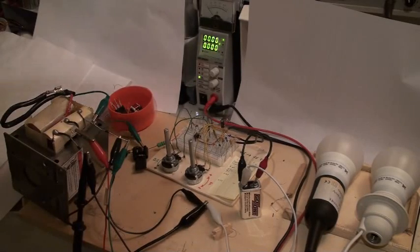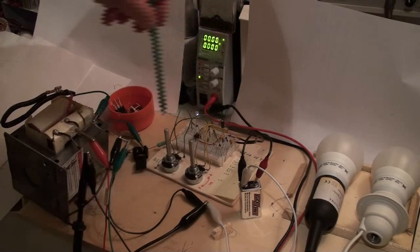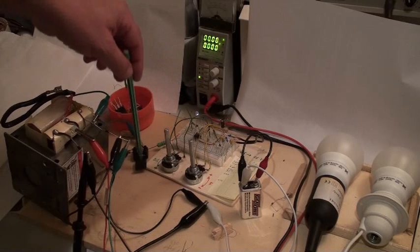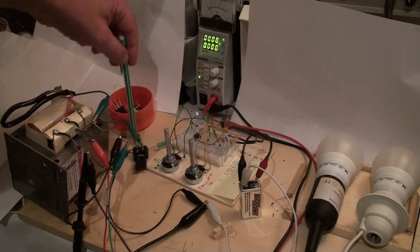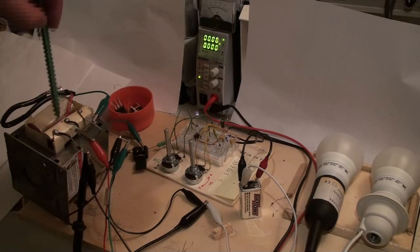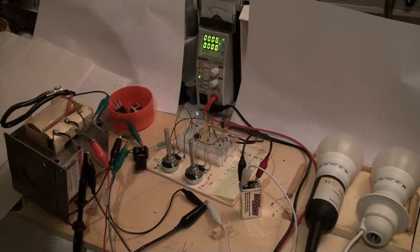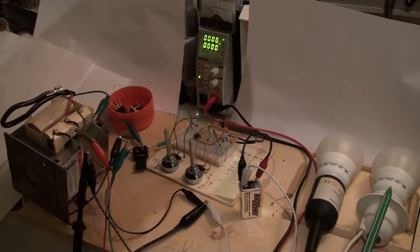On the actual hardware, this is the 555 — you see a bunch of small capacitors here to test different frequencies. This is the duty cycle potentiometer, this is the frequency variation depending on the capacitor. This is the one MOSFET here, with a small resistor and a small diode between the drain and source. The coil for tonight will be a microwave oven primary transformer. The two ultrafast diodes go to the lamps. One lamp — the black one — is connected to the circuit; the white one is connected directly to the grid.